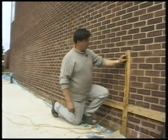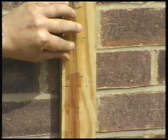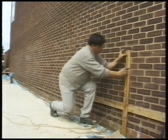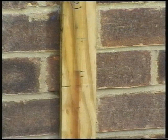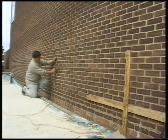A tip for finding a level is to use a piece of hose with water filled in it, within 8 inches from the top. Water will always find its own level. Once you have got a mark that you want to transfer, it doesn't matter what distance you move — you can always transfer that datum easily without any expensive equipment. This is accurate to within 1/16th of an inch per mile.